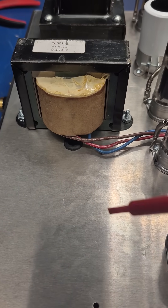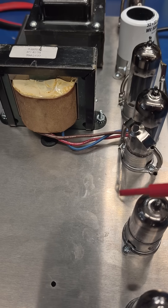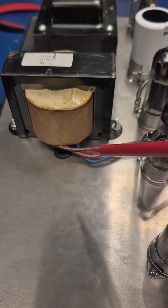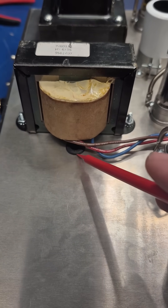What's going on is the inductance from the output transformer is getting into the inverter tube. That's why if you pull that tube, it goes away — but that's fooling you. The real issue is the inductance of these leads is getting into the inverter circuit. So what you do is you pull the leads out from that rubber grommet and come over here.